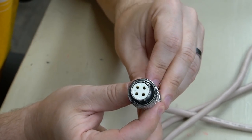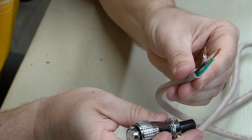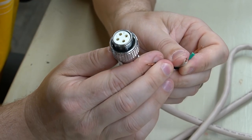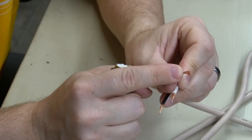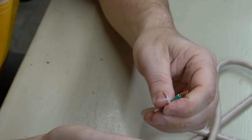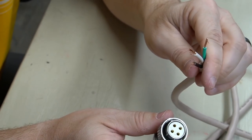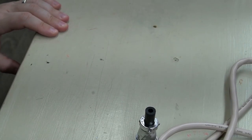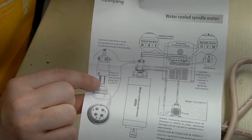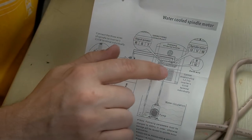You'll notice there are four pins in the aircraft connector — four holes for four pins — but my wire only has three. That's because I live in rural Arkansas and I cannot find a wire that has four. If you're an electrical person, you're going to mock me in the comments, and that's fine, because I won't have a ground and I'm going to be using the ground wire as a live wire. I will know this. Nobody else is going to be using this machine. The VFD instruction sheet literally only shows three wires connected anyway, though they do show an earth wire.